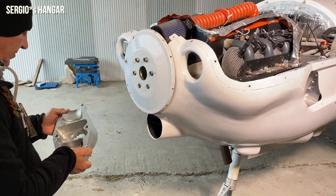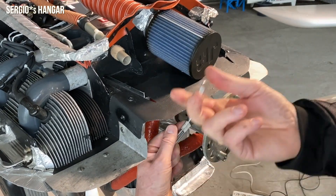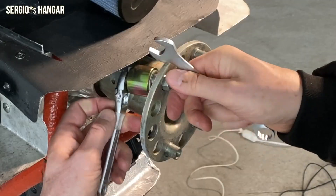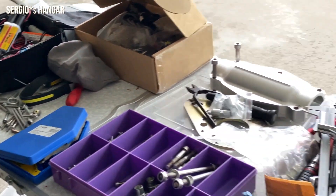The pitch angle is adjusted manually or automatically with the constant speed fly box instrument. A visual indicator of the pitch is provided with the propeller. The power and command of the variable pitch system are fully electric.